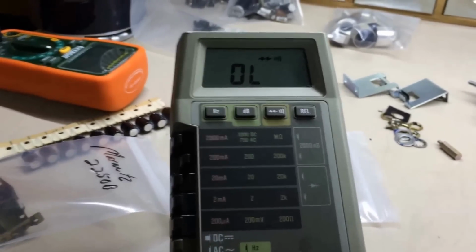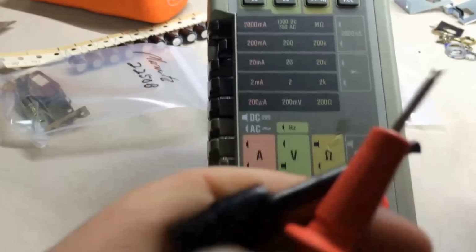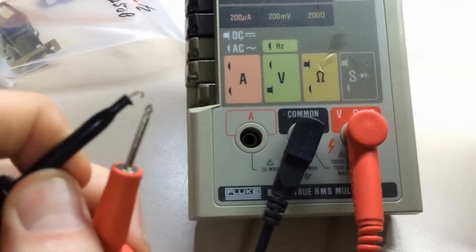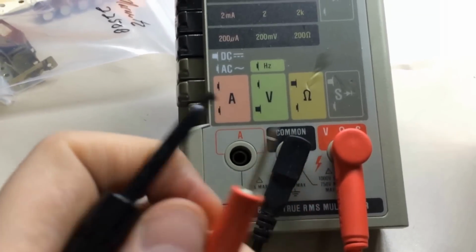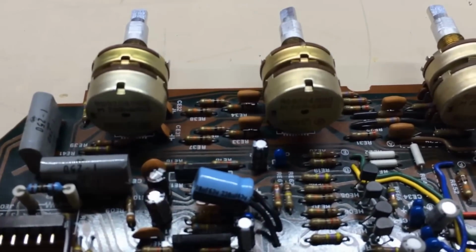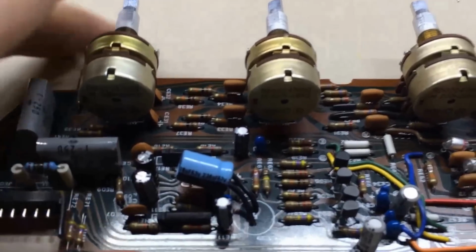So what I did was start tracing, using just an old Fluke meter that I have set up. I set the unit on continuity, so when the 2 ends touch, it beeps. I had one end set up with a little clip, and the other end with a little touch probe, and you can see when I touch them they beep. What I started doing was coming over here, tracing the power input and chasing the audio input signals through, just seeing if anything was shorted or whatnot.